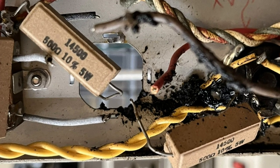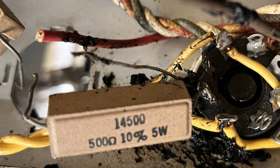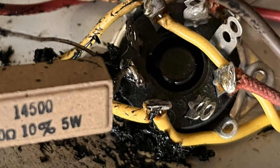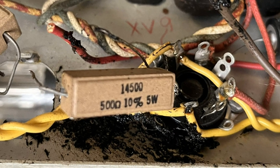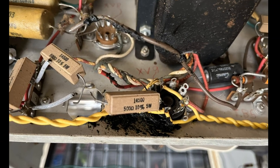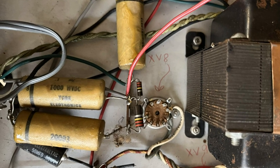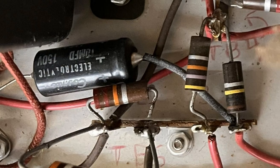With that keen eye and attention to detail, it doesn't take long to notice that gaping hole in the chassis and some black goo oozing away from it, running over the connector for the tube rectifier like a breach from the La Brea tar pit. Clearly a catastrophic failure of some sort involving the filter capacitors. So you look around and take note of other potential issues, like the three high-powered paper capacitors leaking wax all over the inside of the cover.